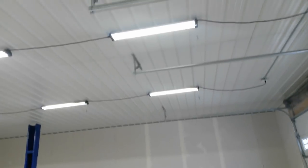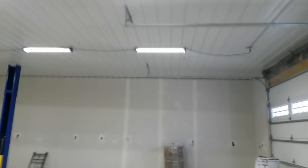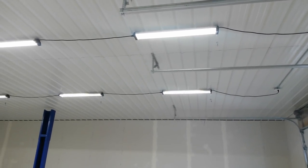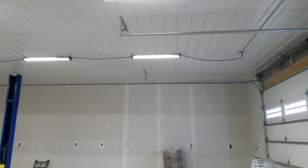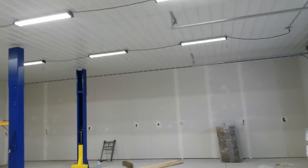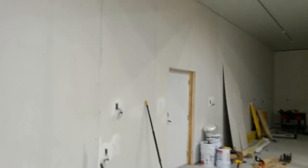For OSB you're probably looking at around four foot on center, though they might want two foot. The difference between six foot on center trusses for a metal ceiling liner versus drywall was a $20,000 difference, which seemed outrageous — because the drywall trusses had to be engineered trusses at two foot on center. But still, you're only adding another 13 or 14 trusses.